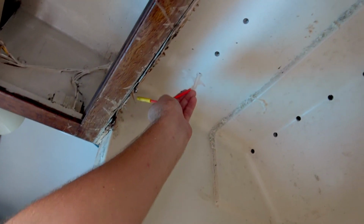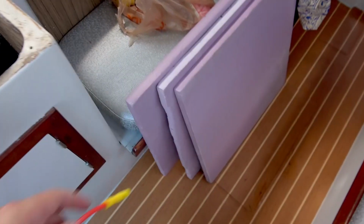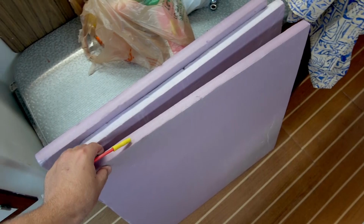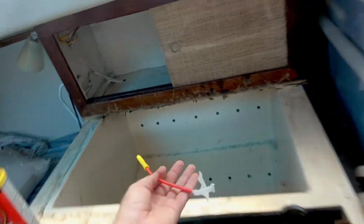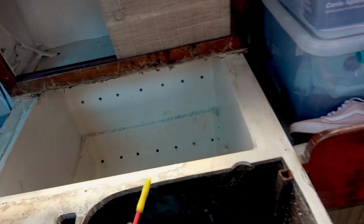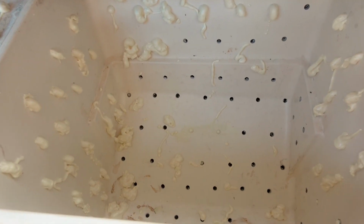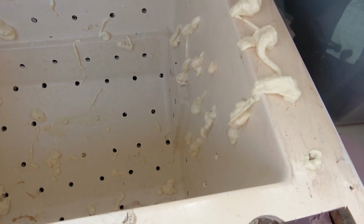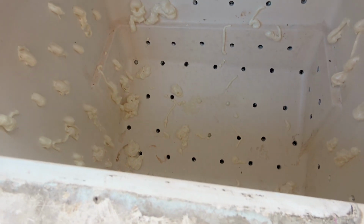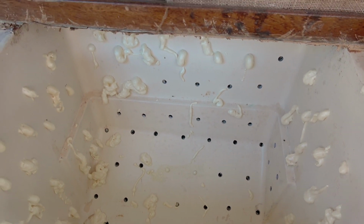and all like three rows there, and then I will be putting a new plank in here and using this insulation foam. I'm going to build that up onto the planks at the top here and then seal the edges with this insulating foam again. So I made plenty of holes in there, and then I squirt it in till the stuff just comes squirting out back at me. Don't worry about the mess. This is stuff that you can cut away.